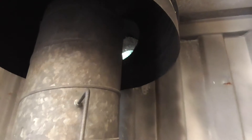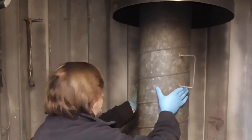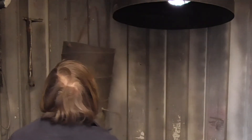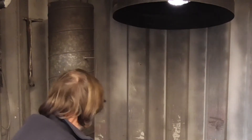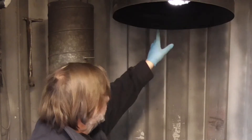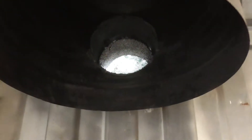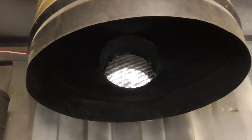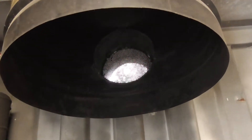Ventilation wise, I originally had a fan up there. I'll just pull the chimney out of the way and let you have a look up there. The chimney just hangs on a hook at the top, up inside, and I've got another hook just here to keep it out of the way when I want to get stuff in and out of the furnace. Other than that, the flue just goes back on and carries the excess heat out. So there's the hot air flue. I used to have a fan on there, and it worked pretty well for a year and a half and then burnt out, unsurprisingly. It was run with some pyro cable that ran straight into it. But I've not bothered doing it again.